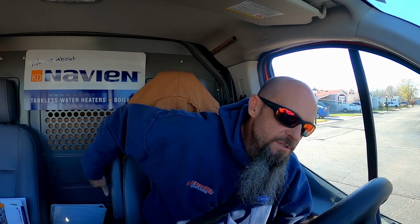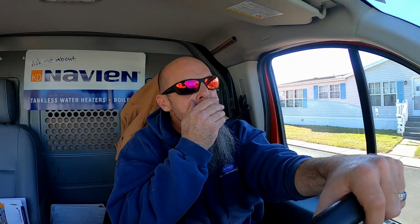Well, that customer opted to do a new furnace. That furnace was installed by us in 2007, and the furnace is kind of large. I'm going to downsize the furnace from a 90 to a 70. And I think that's most of the problem. I think what happened is when that job was sold back in '07, they just replaced what was there. So they did like for like, not paying attention to anything else.